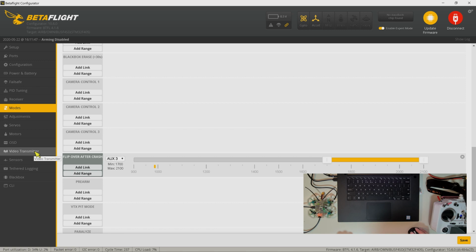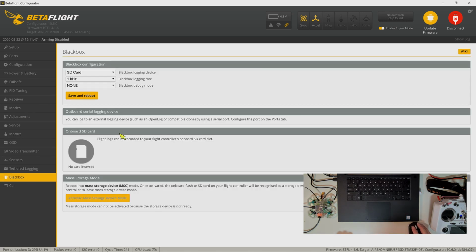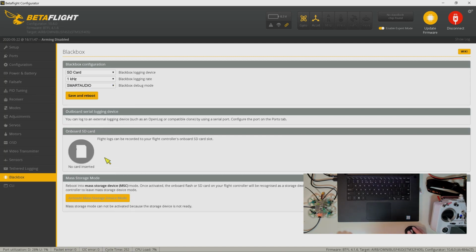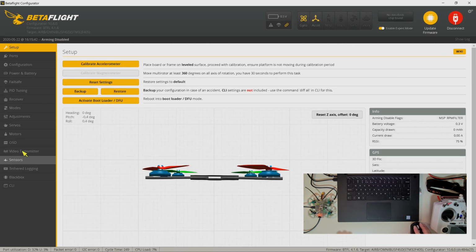Okay, we have Betaflight 4.1, we have VTX now. Okay, this one, we have to check what is the version of the smart audio. We need to go into the sensor, the black box. We need to click here under the selection, select smart audio, and then click save and reboot. And then we click on connect. Again, let's go to the sensors tab,